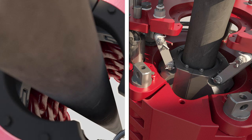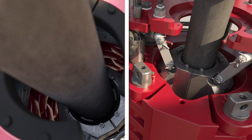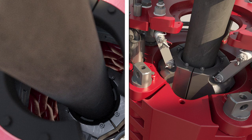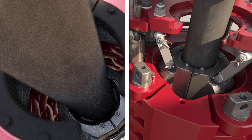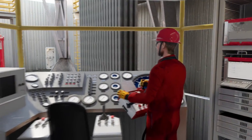The interlocking spider and elevator in the Weatherford Integrated Safety Interlock System, ISIS, prevent casing and tubing strings from being accidentally dropped. The system enables intelligent remote control of the spider and elevator from a safe position anywhere on the rig floor or from the driller's cabin.